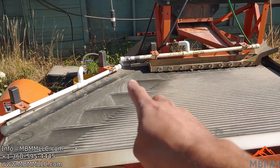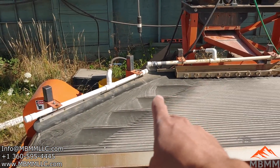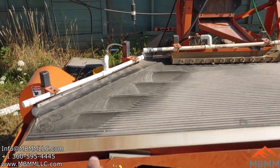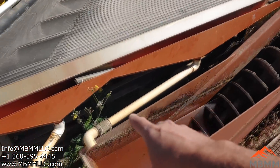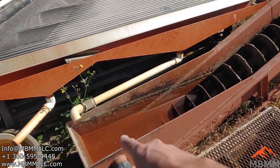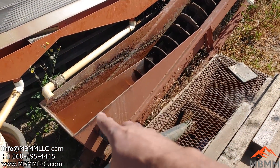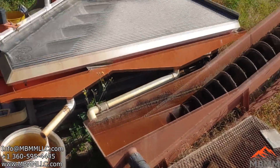It's going to crush it down to about 70 percent passing 30 mesh and about 50 percent passing 50 mesh. It'll get mixed with water and feed down this little chute onto our shaker table. All the heavy dense material is going to come across here under the water bar — hopefully we see a nice little gold line. Any sulfides or galena will work their way down into number two and number three. Using this aluminum splitter we can split the cuts between three and four, the tailings. The tailings and most of the water go down into our spiral classifier, where large pieces of quartz and tailings settle, auger up, and collect in a bag. All the water and finest material recycles back through the system via our sump.